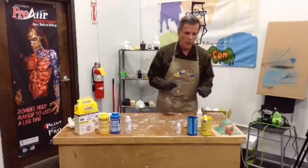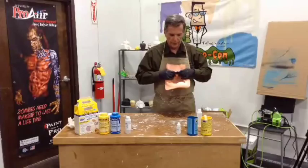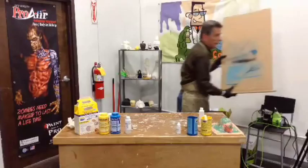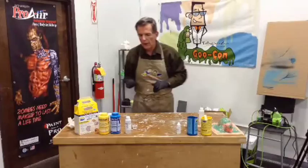While that's going on, we're going to go over to this side of the table where I've set up a couple little teeny batches of this stuff called Rebound 25, which is the rubber that we would use for making brush-on molds, kind of like this. See? This happens to be a turtle. Can you tell? I'm going to show you what happens when you put silicone thinner in it. Then I'm going to show you what happens when you put Thivex in it, which is the thickener. So you'll see. Then we'll demonstrate on the handy-dandy board over here. You might recognize this one from last week. I'll show you how it runs, and then miraculously, it doesn't. So without any further ado, here we go.